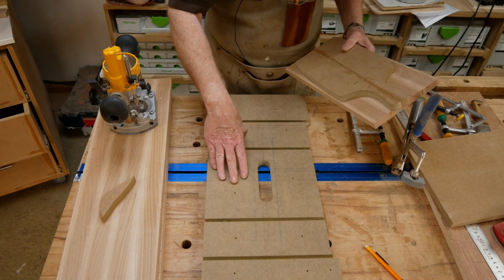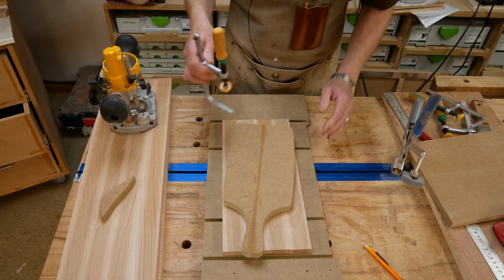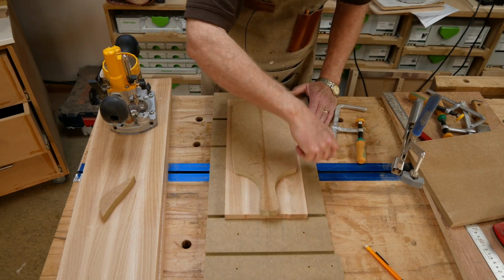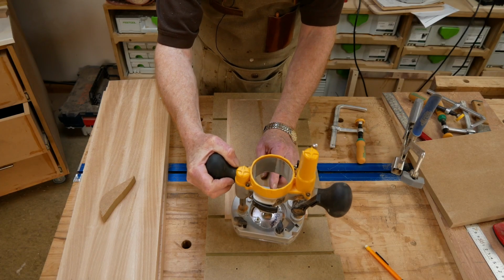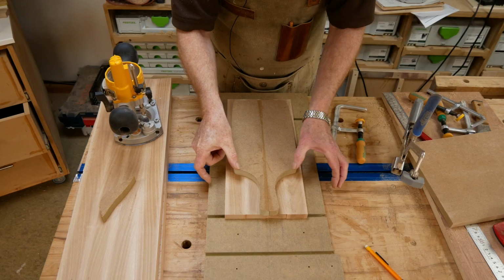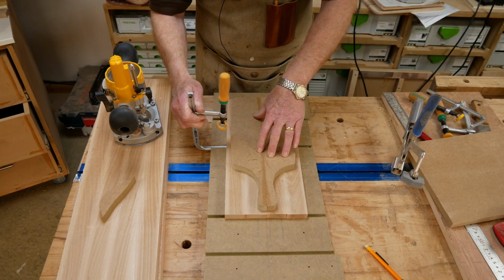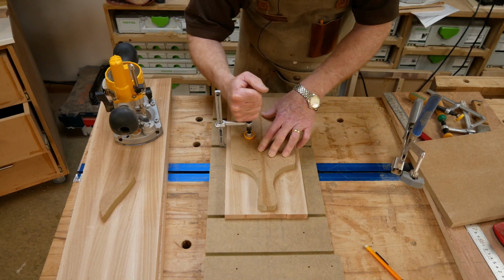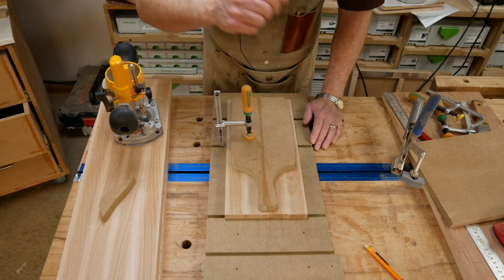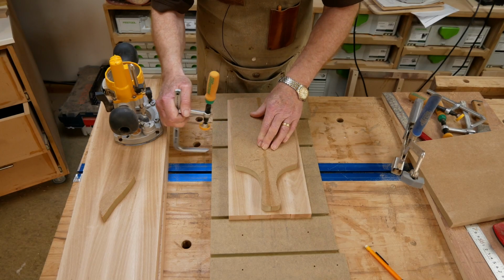So by this way, I found an old template that I used to use for cutting handles in the end of chopping boards. But I've already got the match fit jig router slots in it. So I'm thinking, if I cut some extra MDF to go around the top to help balance, because once I get up there, I've got a real greater chance of tipping off and then gouging into the workpiece. So if I cut something over here that will help to support the router, then with these match fit clamps, I haven't got to bother with any tape, I haven't got to bother with any super glue or any clean up afterwards. And I can use a straight cut router bit to cut off these bits and avoid having to go near the bandsaw. So let's give this a try and see whether it's the better of the two options.